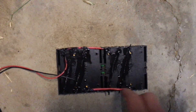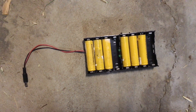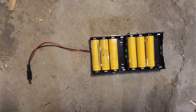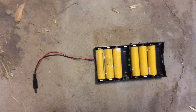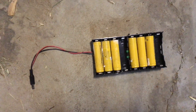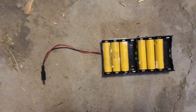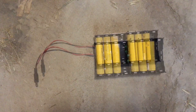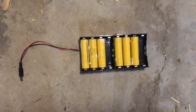I've just zip tied that together. If I wanted to I could pull out all these three batteries — that's still at 12 volts. The reason why I've got six is because when I only had three, as the voltage dropped down to about nine volts, these three batteries would get really really warm. I suspected that was because it was trying to pull too much current. The DVD player is a pretty sophisticated unit — it's got two screens powered off the batteries as well. So to keep a better current draw, I've got two sets of batteries, so if the DVD player pulls three amps I can have 1.5 amps out of both.